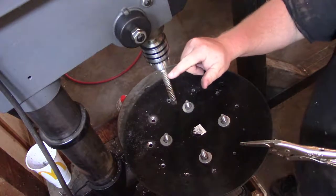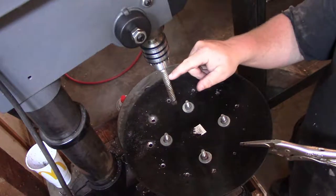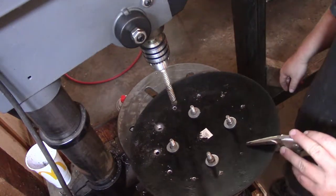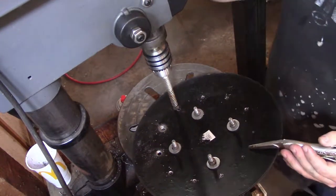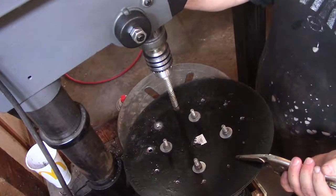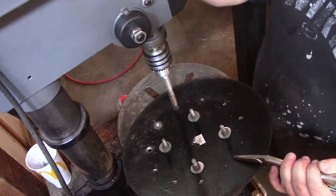So I'm going to try something I was told long ago in harder metal works. I don't know if this will work — it's a masonry bit. I sharpened it up on my grinder and the tip is really hard compared to regular drill bits. So let's give it a try.